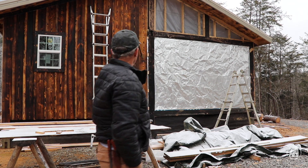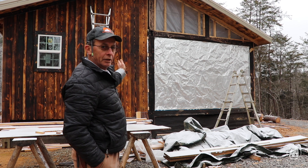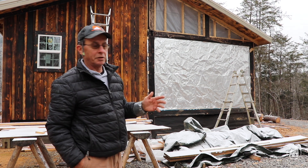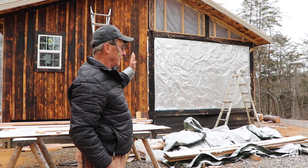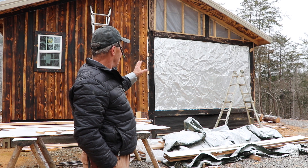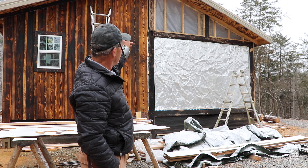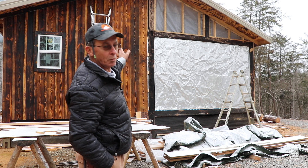As you see, I have almost half of it done. I lack two battens - I got that far and quit that day. I did put up this radiant barrier yesterday. The other day when it was raining I spent most of the day on it and didn't do any filming. I've got basically four sections left to do, and I've got all of the 2x4s or the cladding cut for all of those. Here in just a little bit I'm going to get ready to start work. The only thing I have left is to cut up there at the top - I need to run some horizontal 2x4s because it's too far stretched not to have any screws on the boards when I put them up.